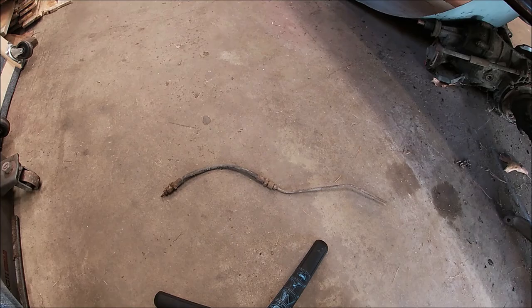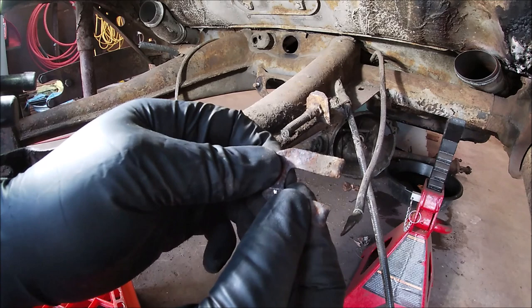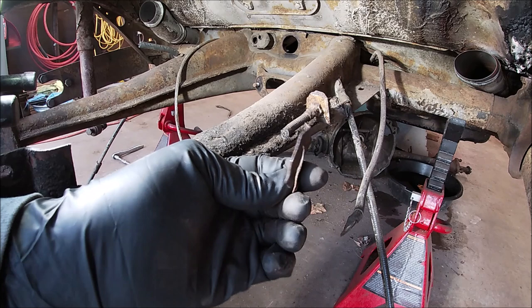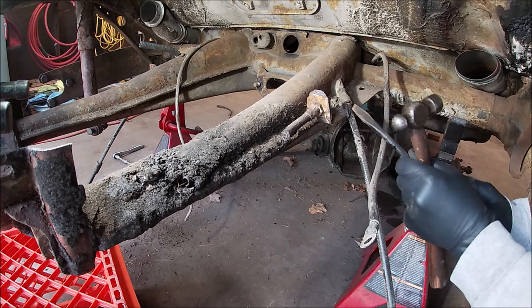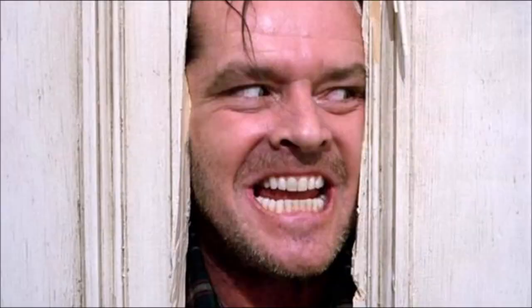If you needed to know what that clip looks like if you're new to this — it's just a horseshoe clip. I do have new ones, but you can reuse these if you straighten them out. Take it easy on these — they're pretty strong, but if you do bend one, gently bend it back. Don't get crazy and start bending it back and forth.